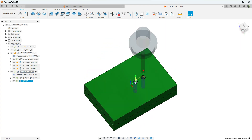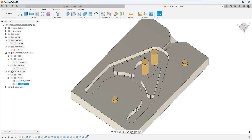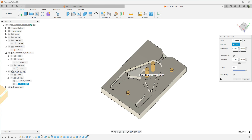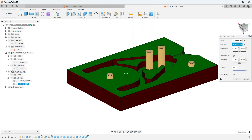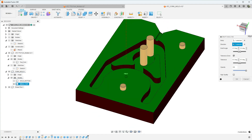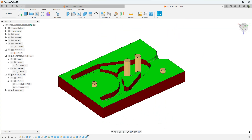I think overall it's going to turn out well. My main concern is release — you can go into Fusion 360 and do a draft analysis under Inspect > Draft Analysis. Select the body and the pull direction, and you can see these side walls are really dark red — you don't want to see red. To solve this I could use a tapered end mill when machining to put a slight taper on all of these edges, but since it's not that thick I think it's going to be okay.